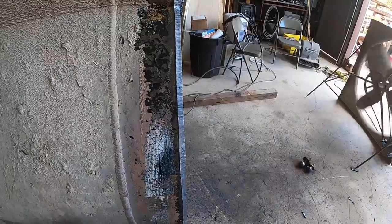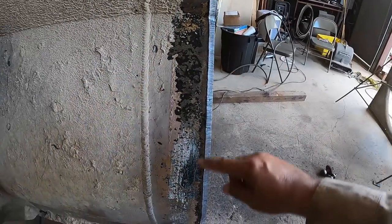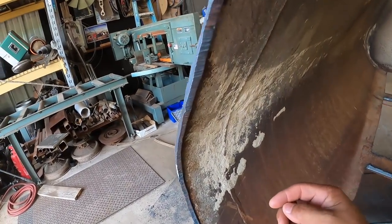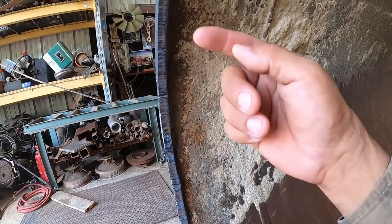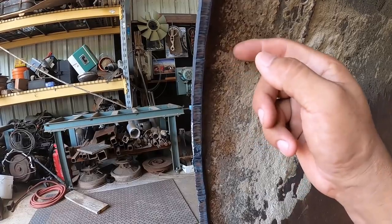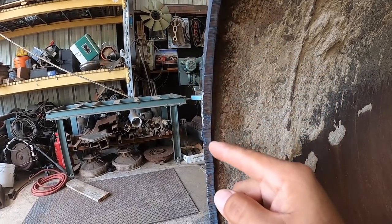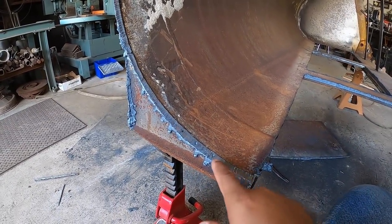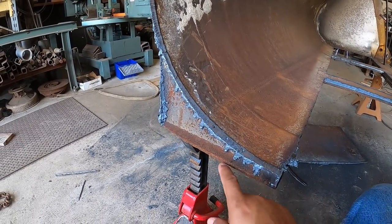Of course, I won't do it now, but once I do that all the way around, it's a lot easier and a lot quicker than trying to gouge this outside weld and then trying to gouge this inside weld. And so here I'll just do the same thing. I'll get a little closer to this parent metal back here, and then you'll start seeing the separation line, and this whole ring should almost come right off. This will take a little bit more cleanup work. This is coming off.